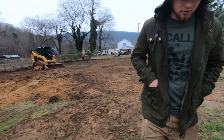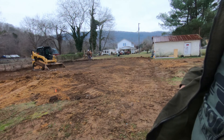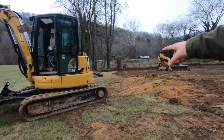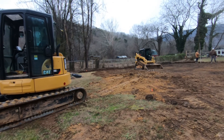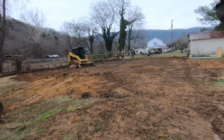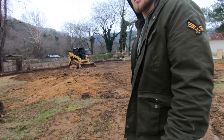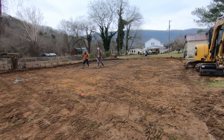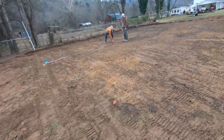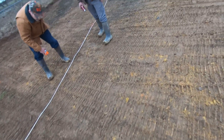We've basically already got the place leveled out, on grade, and all of our drainage figured out. We've got a little spot over here next to the excavator where you see that tar and that flag right there — might need to take it down maybe a half an inch, but other than that everything is looking good. So here pretty soon we're going to start setting our footers. What we're doing right now is setting the footers where they need to be dug.